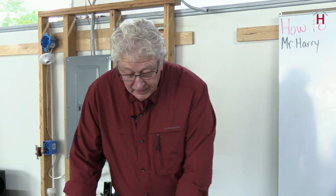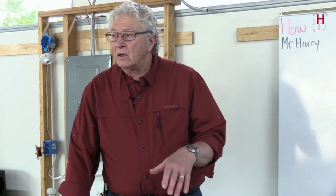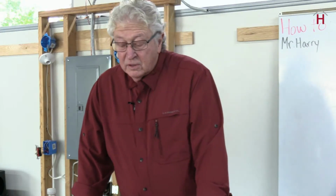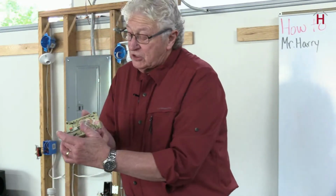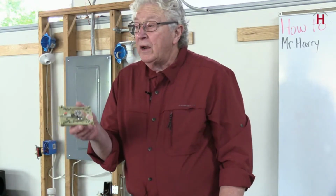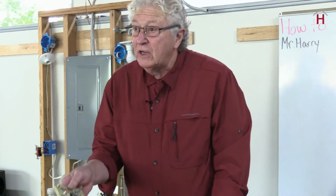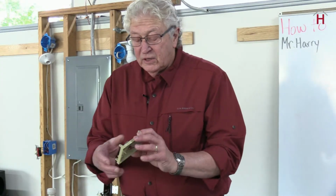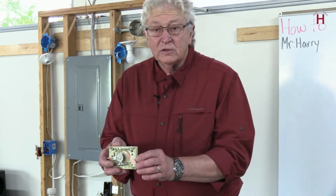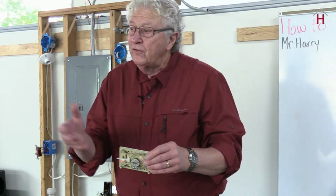And again, just like some of the other more advanced thermostats, they don't always work on all systems. That's a big thing. Well, I'll be honest with you. Even one of these manual thermostats, where you simply change the angle on the coil, won't work on all systems. They'll work on most systems. If you have electric heating of any sort, there's another unit that looks very much like this, but it reads line voltage. Line voltage is the 120 volts that comes out of the wall, as opposed to the 24 volts that a furnace has.